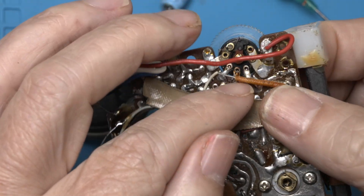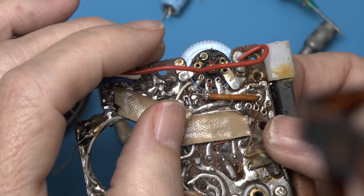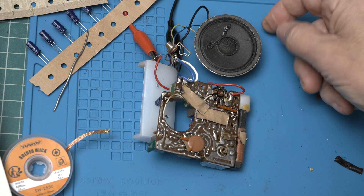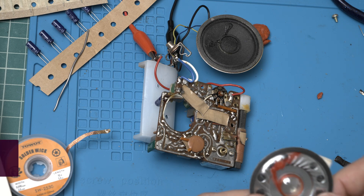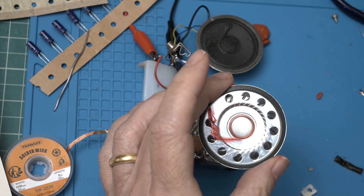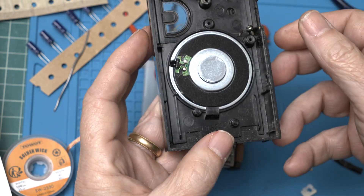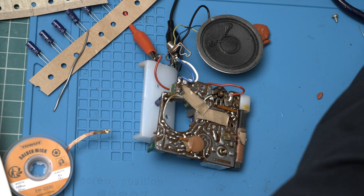It's not just the electrolytic capacitors that have lost a lot of their value over the last 60 years. The magnet that this speaker is powered by is not the same magnet that came out of the factory in 1965, and the paper has gotten a lot more brittle. The super modern equivalents are super thin and actually perfectly fit the case. If you can just put that one in, it's going to sound a whole lot better. Let's do that next.